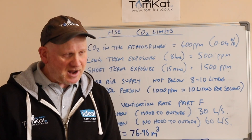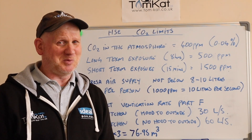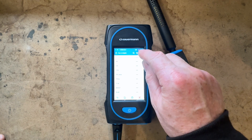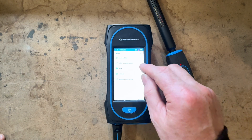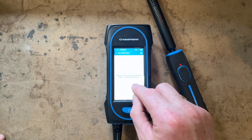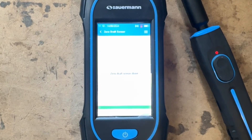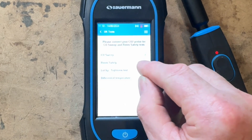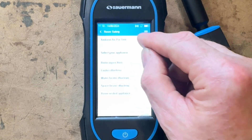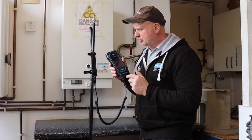Anyway, that's all that nonsense out of the way now, so let's finally get on with it and get this test done. But first let me show you how to turn it on and set it up. Once you've initially turned it on, press the little dots, go into Other Measurements, go into UK Tests, press Start so it purges — and make sure this is connected. We're now going to Room Safety, then Ambient Air Test, and we're now ready to go. All we do when we want to start the test is press Start the Test.